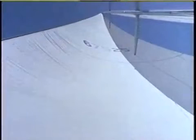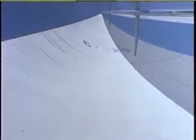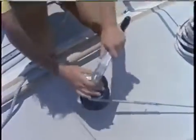We judge correct halyard tension by looking up the sail at the top speed stripes. Here they tell us that the halyard is not hoisted hard enough. Look at the way the sail comes off the headstay. It's too straight, with almost no curvature at the luff, and that means the draft is too far aft. The horizontal wrinkles along the luff are another obvious clue that the sail has less luff tension than the sailmaker intended.